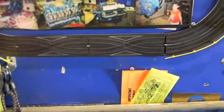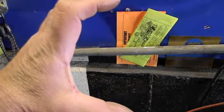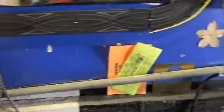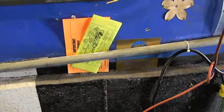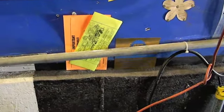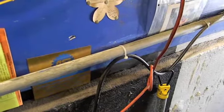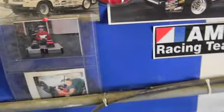The water separator is going to be a fraction of the price of the repaint you'll be doing — that's what it comes down to. That's just my opinion; everybody does it different. At work we had a separate compressor just for the body shop, and on the side of the building we've got two massive monsters with three- or four-inch inlet pipes coming through the wall into one of those commercial refrigeration-style water separators with a compressor and big cooling unit. That works pretty good; we still every once in a while get a little moisture. An ounce of prevention — it's only a couple dollars more to get another separator and keep the moisture out of that line.